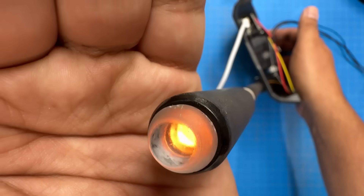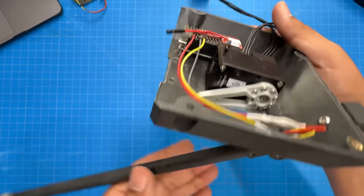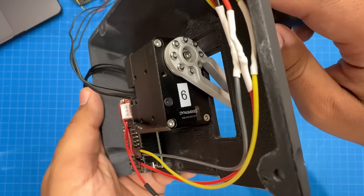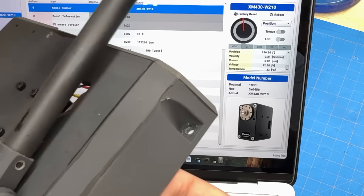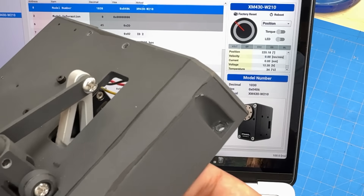I'll definitely have to play around with this design. Now, in order to make it move, I'm using this Dynamixel servo motor. This is a smart servo that can be daisy-chained, and I'm using a lot of them in Claptrap. They can be back-driven and have built-in position sensors, so I can easily see what positions I need to send to the antenna to make it rise up and also fold down, and anywhere in between.